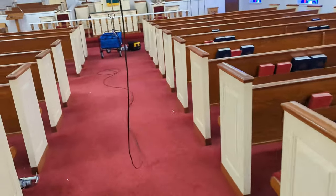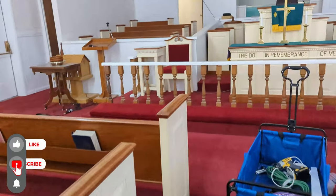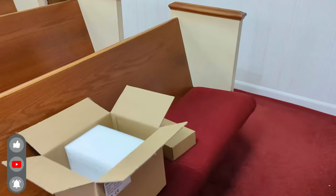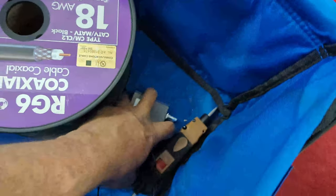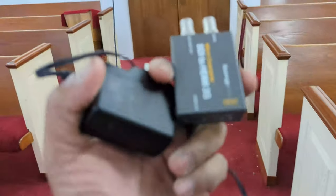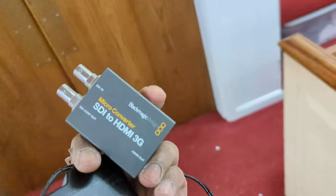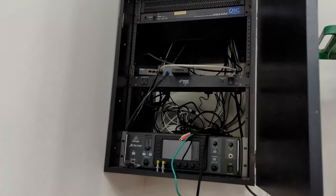This is going to be similar to how we did it at Science and Wonders — have an HDMI to SDI converter and then convert it back for this side. There was already an HDMI to SDI converter on the other side, but it has two SDI outs, so we're just going to connect that to here. And this — this is an SDI to HDMI converter. That is what's going to feed the HDMI splitter here that will go to all the TVs.